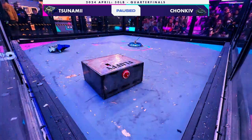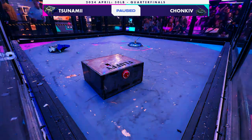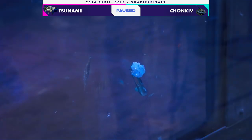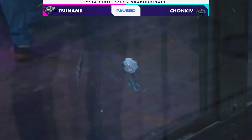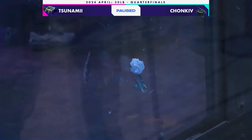Oh, there's a cage breach — oh, look at that. You can see here on the left the sacrificial layer of Lexan. There are two layers of Lexan inside of these boxes — every single one of our boxes. We have one sacrificial layer that's thin on the inside, and then we have a one-inch air gap, and then we have a much thicker panel of Lexan on the outside so that our audience stays safe.